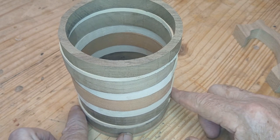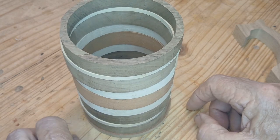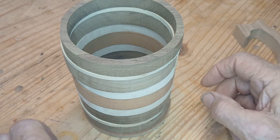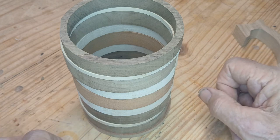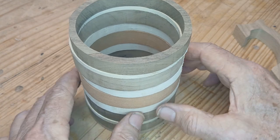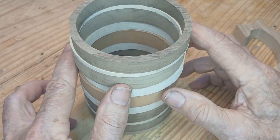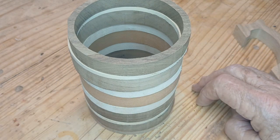I don't know. It's just good woodworking common sense to match grains. In this case, they're small areas, going to be climate controlled, supposedly, and sealed. I don't think it'll be a real problem, but if it does, it'll delaminate, possibly. I don't think that'll happen. That's a fairly soft wood. I believe it'll give some. But you're not talking about a lot of movement in this small of an area.